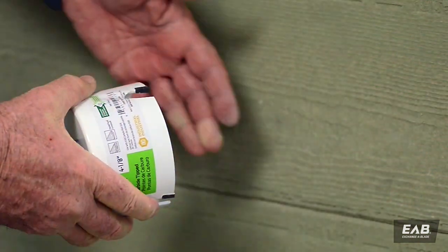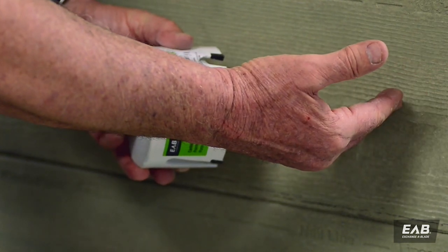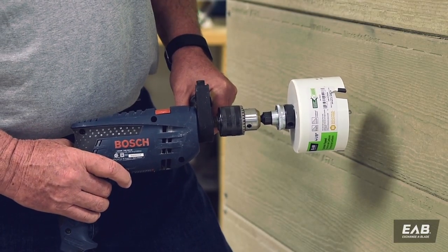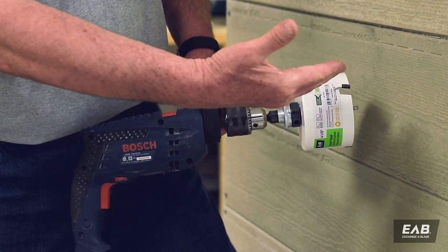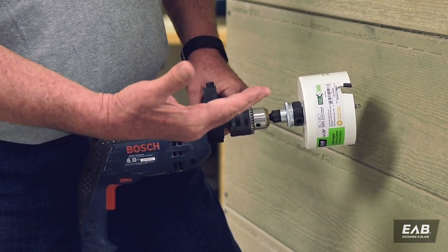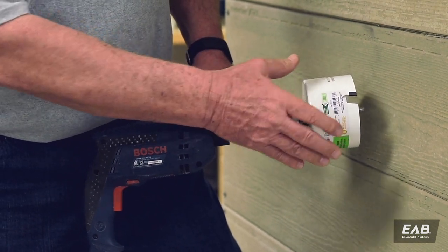because it's meant to go through not only your fiber cement siding but also the substrate underneath — the sheeting on your house — to go right through the entire wall. So we're going to be cutting through the fiber cement siding and through the half inch plywood substrate below it. Remember, as with any of our hole saws, we want a nice slow steady drilling action.